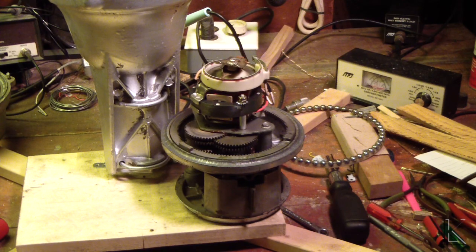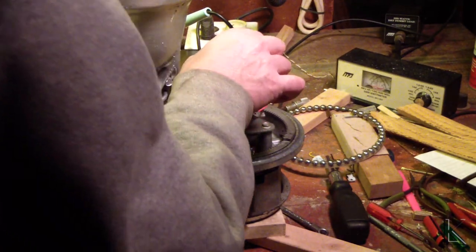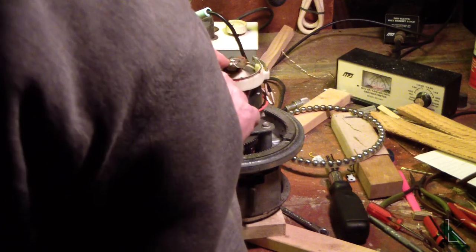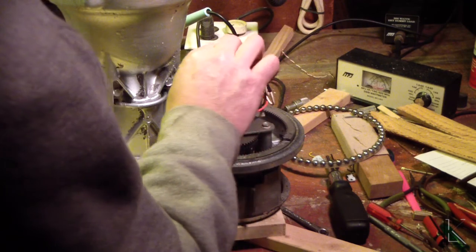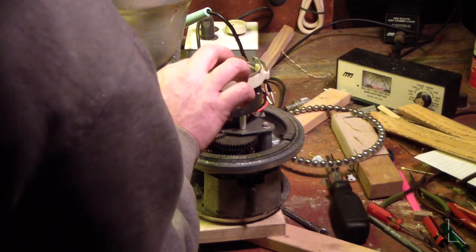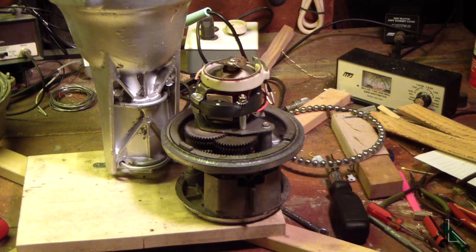This is a brush wiper up here that contacts the top of the bell. And this is the potentiometer that measures which way you're pointing. That brush floats on there, so this rotates around it. This locks it in place at the bottom of the bell — these teeth have to line up with the notch in the bottom of the bell. As the bell rotates, it turns this brush. So that will be the only thing I really have to focus on when I put this back together. I'll also clean this and the inside contact.